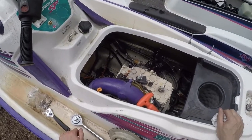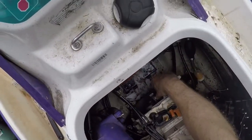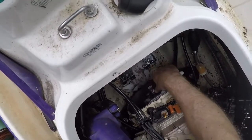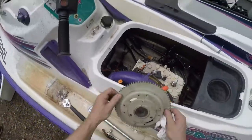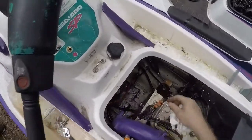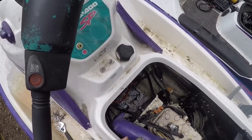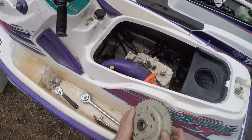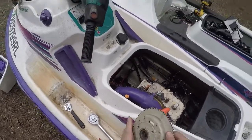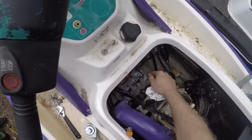What we're going to attempt to do today is, to the best of our ability, keep the alignment of this shaft. The key is in what I concluded is a 12 o'clock position - we'll keep it as vertical as we can. I've marked with a sharpie where the center of the keyway is. We're going to slide that on there, impact the nut on, and then weld the nut to the flywheel and also weld the nut to the shaft.